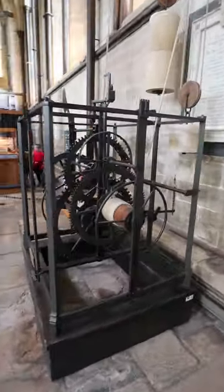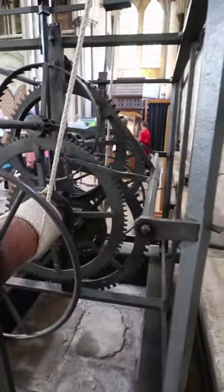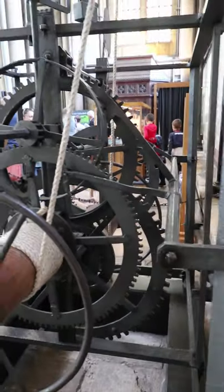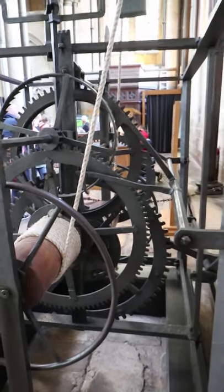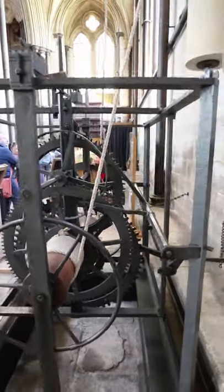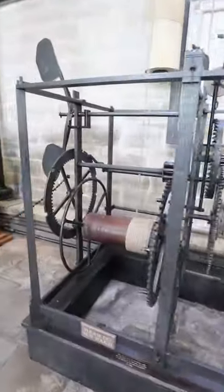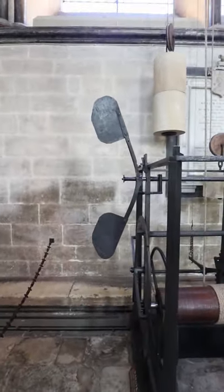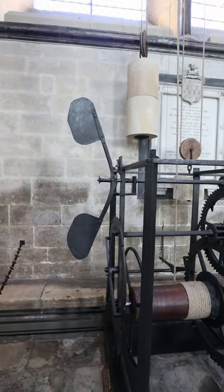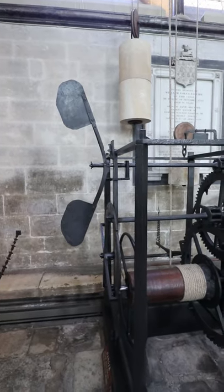When this clock didn't have any hands or a face, it was just for ringing a bell. There's a lever mechanism here on this bar — every one time around on this big gear, there was a pin that would catch that lever and release it. When that lever was tripped, the left-hand side of the clock, which is powered by another weight, would spin this arm in the air. Presumably there would have been a bell that it would have struck, making the ringing noise.